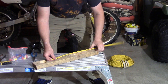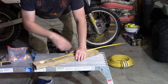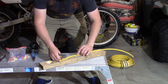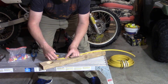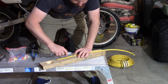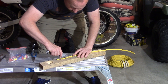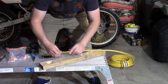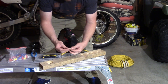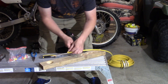Let's say we need this wire and we're at a junction box, so we're going to have some open wires. We've got to attach them all together. We want to take out the outer insulation first — let's say we want to open it up this far. You just want to run your utility knife right through the middle. Don't push too hard — you just want to cut the outer insulation. Then you're going to peel that back, peel back the little paper.